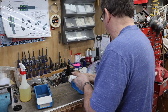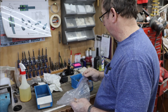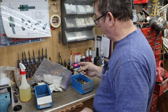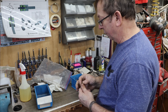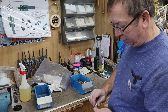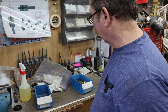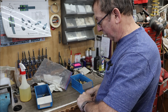So while those are slippery — the ones that were really stiff going through were normal brass. The majority of the rest appeared to be PMC, and it went through quite a bit easier. Normal brass is definitely heavier through the wall thickness. Now while these are still lubed, I'm going to go ahead and deburr the heads of them, throw them back in the plastic bag and shake them up to pick up a little more lube, then run them through my regular sizer die. The 3D printer is actually hard at work printing up a power deburring tool — just a quick little project. After sizing, they'll look like that, and we'll run them through the sizing die one more time, then tumble them again.